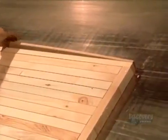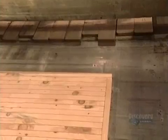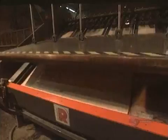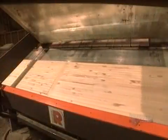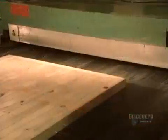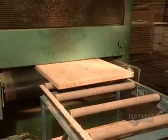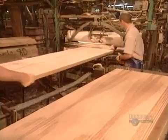They glue together strips of wood to form the middle, then frame them with pieces of white pine. A press pushes the core pieces together, then activates the glue not by heat as most presses do, but by microwaves. Next, they sand and calibrate the core. After the glue machine coats the core, they stick a plywood door facing on each side.